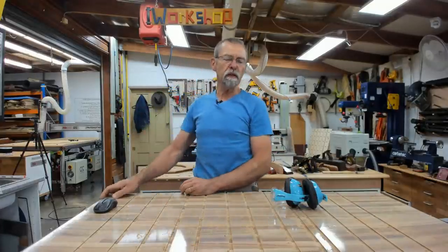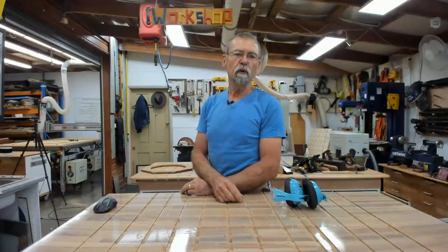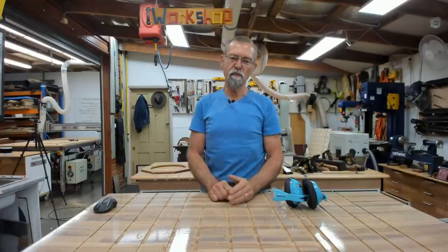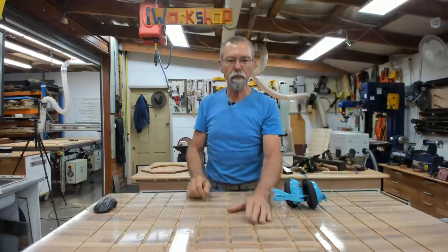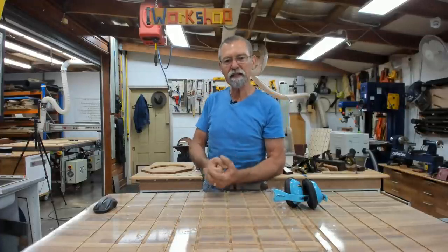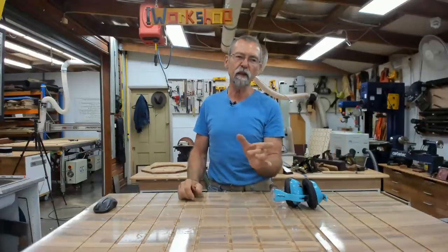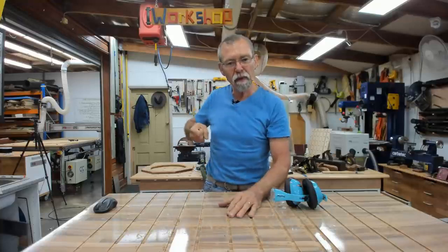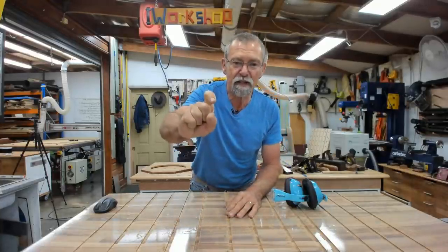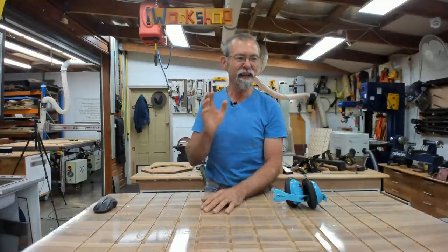Phil, using the Micro Jig, yeah, for small things, it's okay, but I'm a little bit of a fanatic as far as guards are concerned. When I use those push blocks from Micro Jig, the grippers that straddle over the top of the blade, and I'm holding down on something and it's plastic, I do it, I've got them, and I use them in particular areas, but this is just a little bit safer. I like to have the guard, I like to have the dust extraction. Those things straddle over the top of the blade and you push your hand straight over the top of the blade and there's only this much between your knuckles. I just feel a little bit nervous, and I'm a bit of a thrill seeker and that makes me nervous.